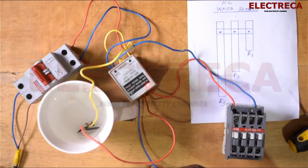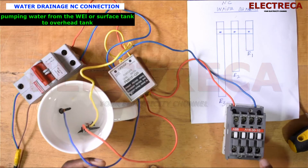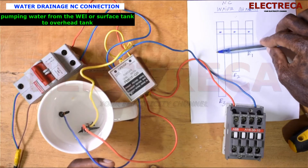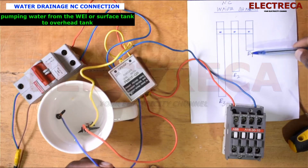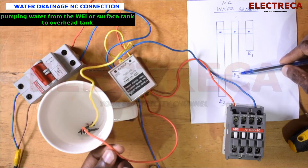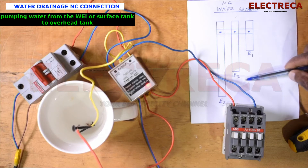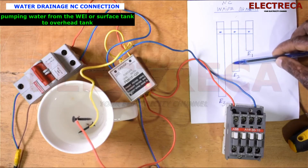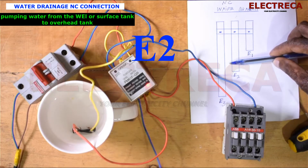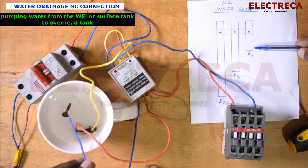We put E1 inside here — we need it to pump water out of the well to the overhead tank. The moment we put this in, you see the pump runs. Now since the pump is running, all three electrodes are inside initially. If that water drains and passes E1, then continues down and passes E2, your pump will go off. Since it is a well, your pump water goes down — you wait for the water level to come back. The water will fill back up to E1, and that's when the pump will run again.